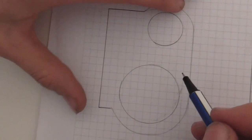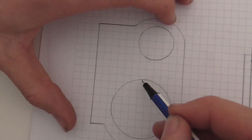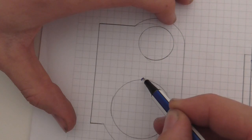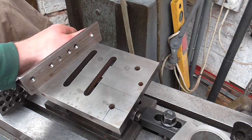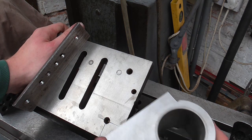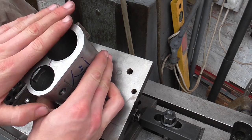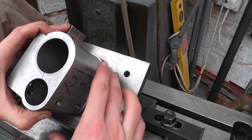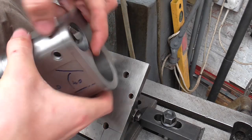The effect of this is that when we look at the end elevation of the cylinder once the slot's cut, we'll actually see a little step, sort of like that. So I'm going to do it by means of the adjustable angle plate and the cylinder block will clamp on there. I can get my 12 degrees, I can get my 40 degrees, and I'll be machining from bottom to top, sort of upside down.